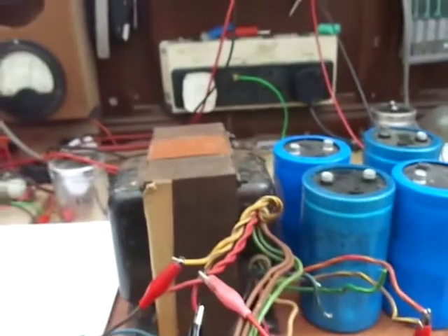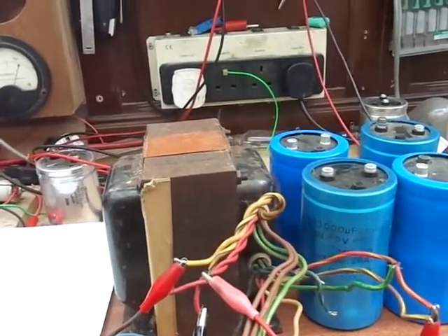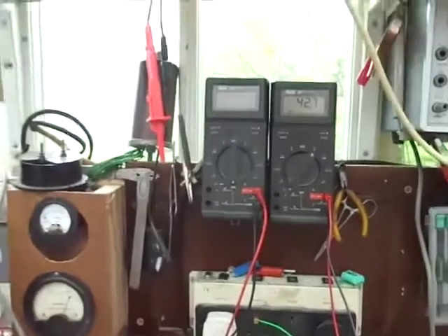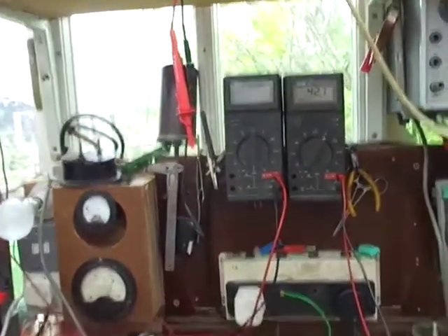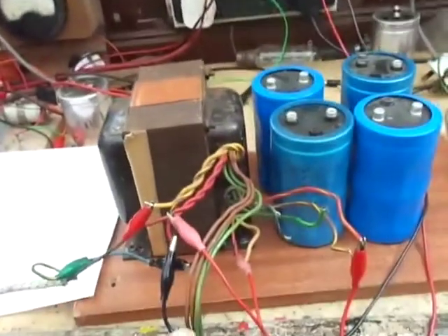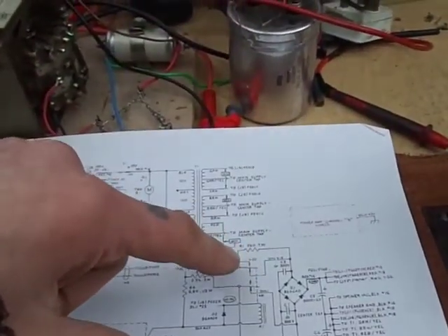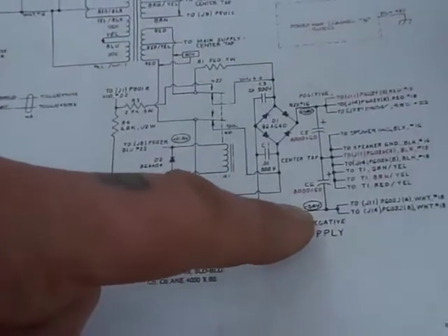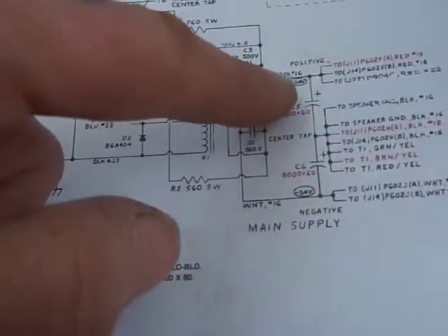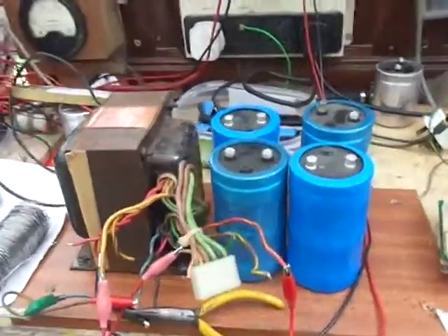Right, I'm presuming everything is cushy. Set that to 230 because we're 10 volts higher — I've got an output of 42 volts AC. Once that's rectified it should give us — let me check the schematic — 54 volts: plus 54 volts and minus 54 volts. Battery just run out, I'm going to film a little bit more before I nip out.